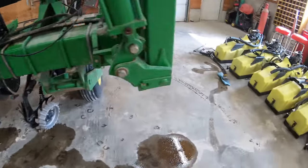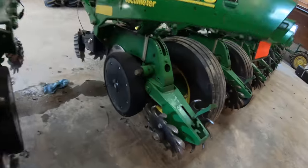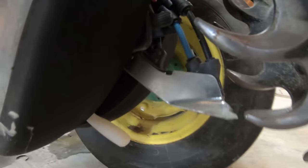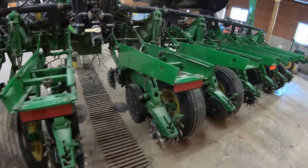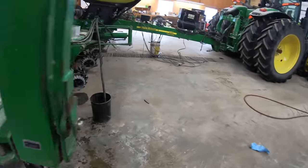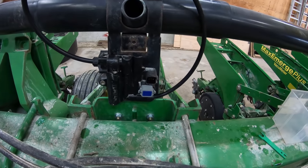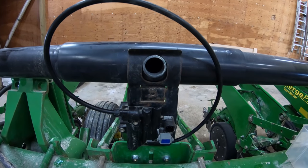and unmount it. And I think one thing I forgot to say is we do have the furrow jets. Some precision planting here we used last year. I'm kind of up in the air on them just because I had some issues with them in terms of trying to get the right amount on and getting everything calibrated. So it could be user error, operator error, but as you can see, I've disconnected some of the lines here and the hydraulics to save from starter fertilizer from flying all over the place.